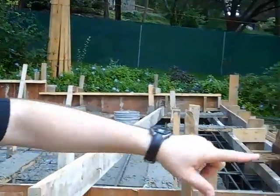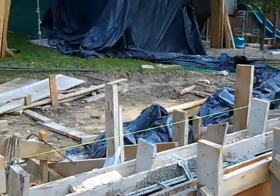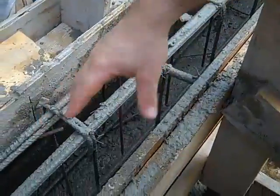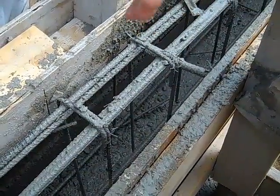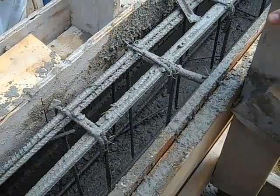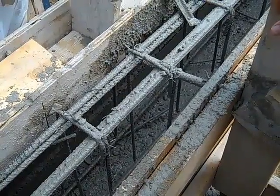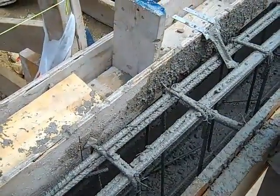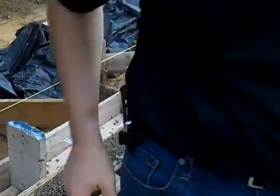This is actually a floating slab on the back. We've got a perimeter beam — if you look on the side here, we've got a perimeter beam on this job. That perimeter beam also has a void form at the bottom, though it's tough to tell now because we've poured it with concrete. Underneath that concrete is about a 10-inch deep void form with corrugated plastic on both sides to keep water and soil out. We've got our stone pocket on the back, and next time we film over here we're actually going to be pouring a slab in this crawl space and making it a conditioned crawl space.